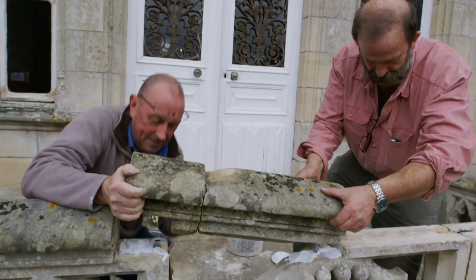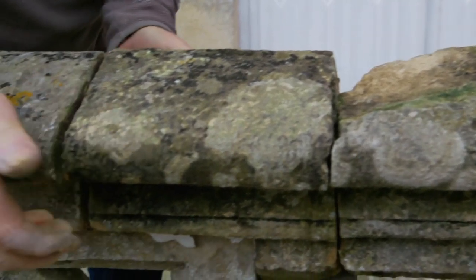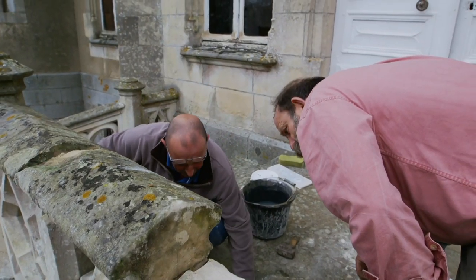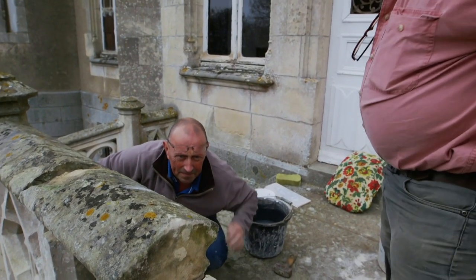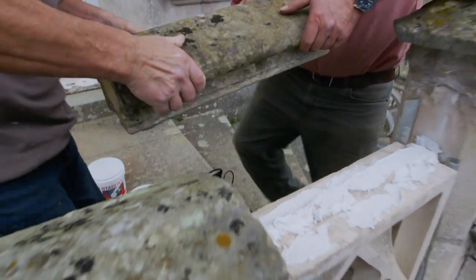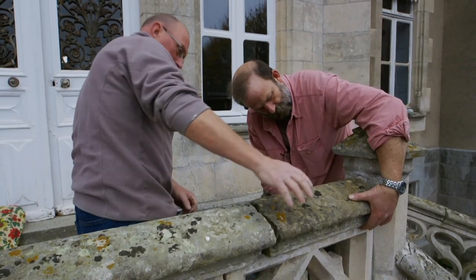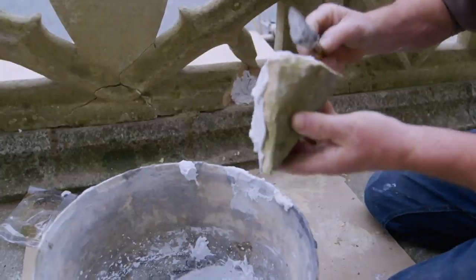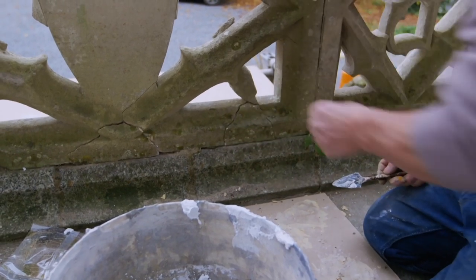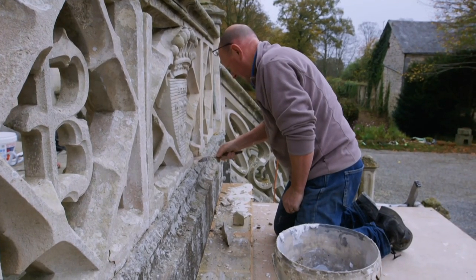All the rods Dick made from his old tools are set in position so the last pieces of the jigsaw can be put back together. The stones sit on the pins and once set they're going nowhere. The last pieces of the balustrade are returned to their rightful spot, and the mortar — mixed with the baked sand — blends with the stone as Steve fills in the cracks.